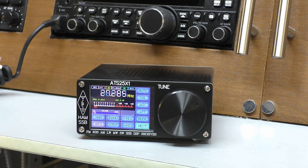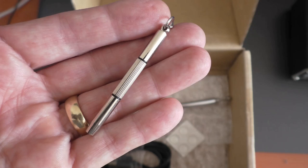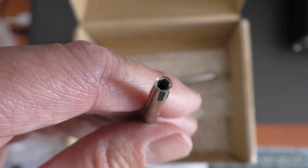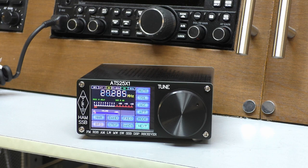With this radio you're not going to get the best out of it unless you use an external antenna. Even a single long wire helps, although on these cheaper radios you're probably better to use a coax that has some earth screening — that will cut down on interference. In the box you also get little rubber stick-on feet that you have to put on yourself, and this rather weird key ring thing. I thought at first it might be something you prod the screen with, but no, it's a three-way screwdriver and spanner. I'm not really sure why they've given you that.